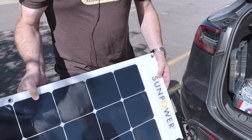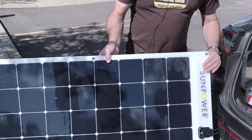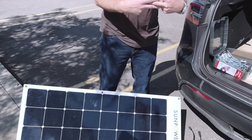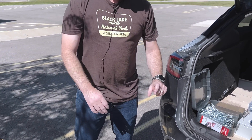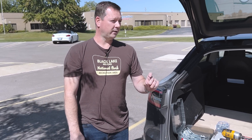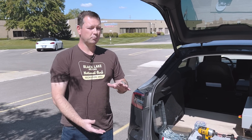How I'm going to stack the panels is each panel is going to be face to face, with junction boxes interlaced so the two junction boxes on either side come together. For four panels, I'll only have the stack height of one junction box — about an inch per four panels. My full stack of 64 panels will only be about a foot tall, so it's really compact.